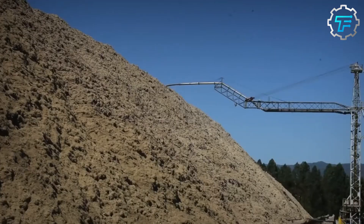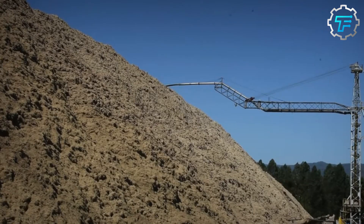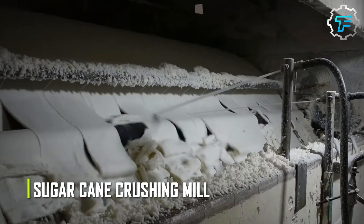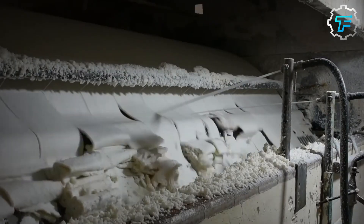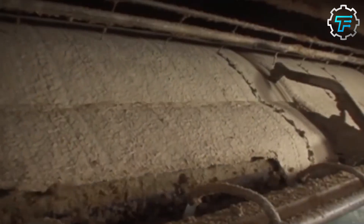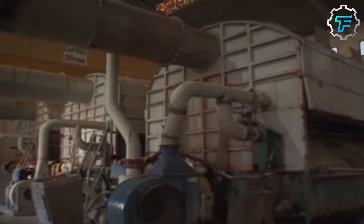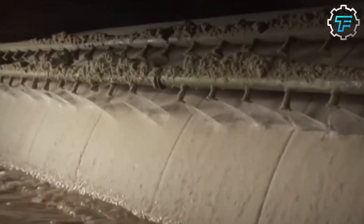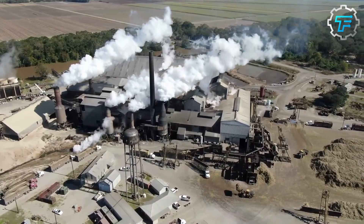After the canes are cleaned, they're cut into smaller pieces and placed under a machine where they are crushed. The machine used to crush sugarcane is simply called a sugarcane crushing mill. These machines have swing hammer shredders or heavily grooved crusher rollers, which get the job done. Before the stalks are crushed completely, they are put through a series of five mills which heavily compress the stalks and squeeze out the juice until there's no more juice left in them.